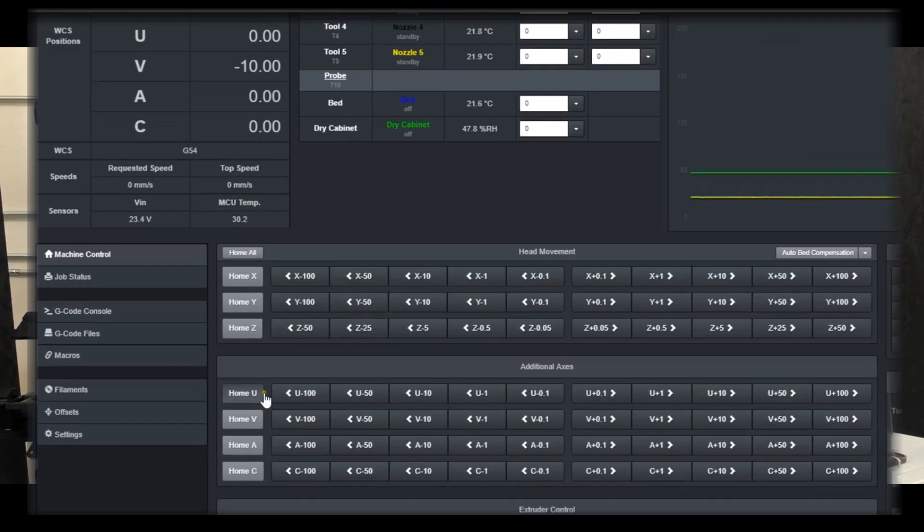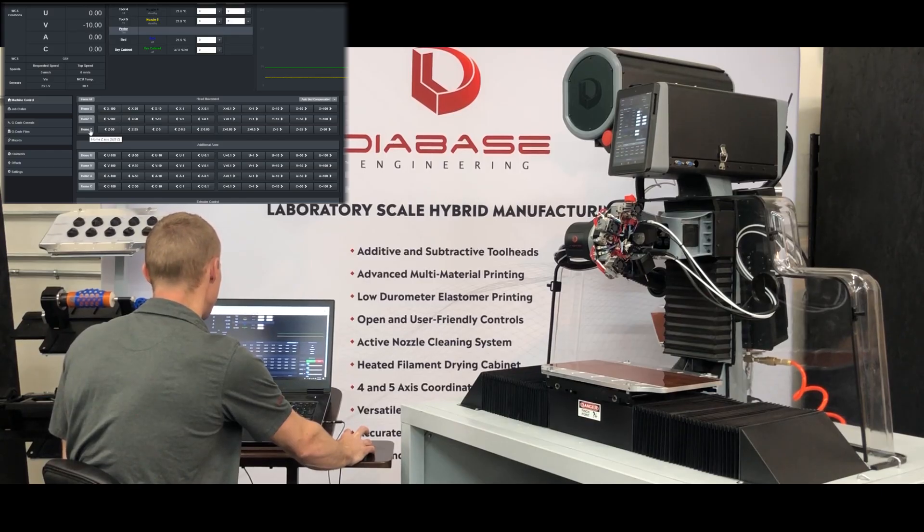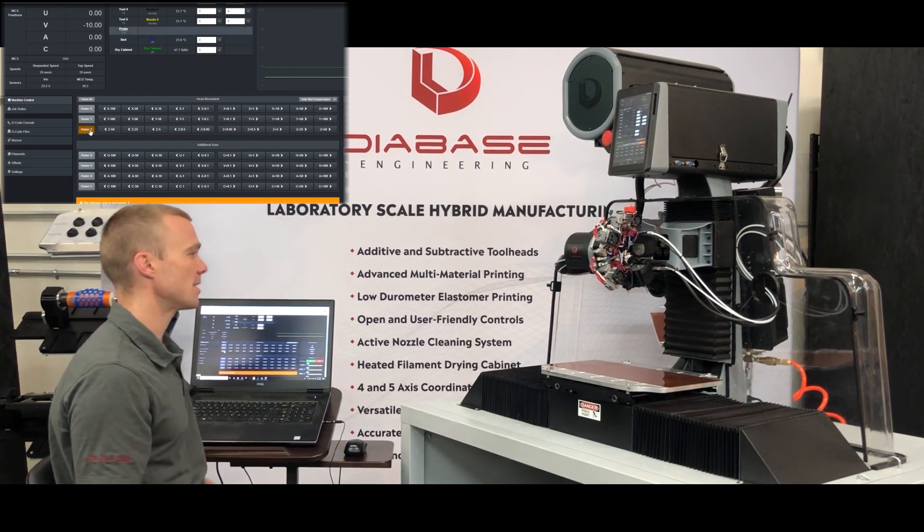What we will want to do is come down and define the location of the bed by clicking 'Home Z'. These buttons are not all that intuitive — 'Home All' is what we just saw; 'Home X' will send the bed to the end of its travel to its end stop, and 'Home Y' will do the same, but in those cases they just stay at the end stop. 'Home Z', on the other hand, rather than just moving the Z axis to its end stop, will call up the touch probe and probe directly down — it won't move X or Y, it'll just go straight down in Z until it makes contact with something, in this case the bed.